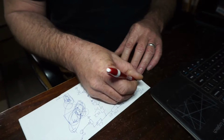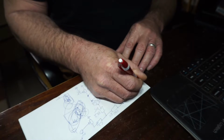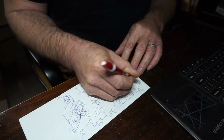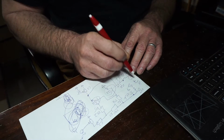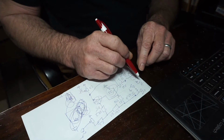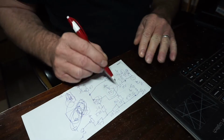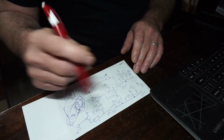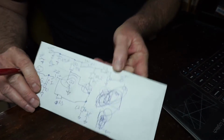And then here we will have a ground, minus in. And then that will be grounded. That's important when we're doing the schematic in here. You gotta make sure anything that's gonna be a ground pad has a ground on it, or you at least renamed the net after it to ground. Even if it's not connected to anything, run a net off of it, label it ground, and it'll connect it to ground for you. So there we go. We've got our schematic.